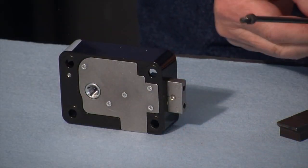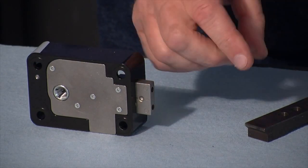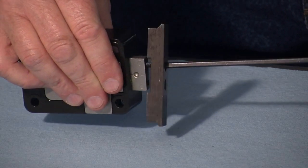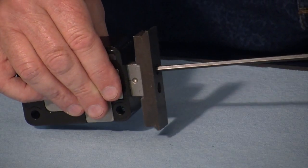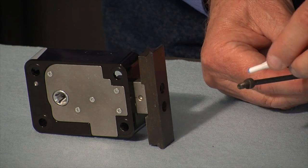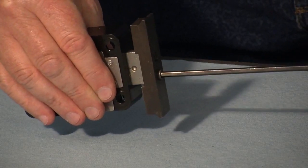The container manufacturers provided two screws. There are holes drilled and tapped in the end of the combination lock bolt for 10-32 attaching screws. Here's one of the screws — we'll put a drop of Loctite 242 thread locker on the threads, then using a hex driver, we'll install that screw. Before we get it tightened up, we'll install the second screw, then go back and tighten both. Our extension will then be in place on the lock body.